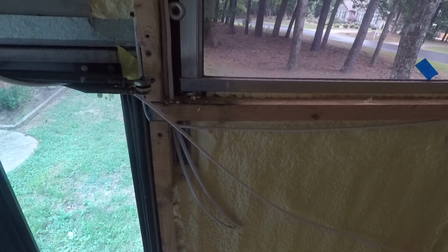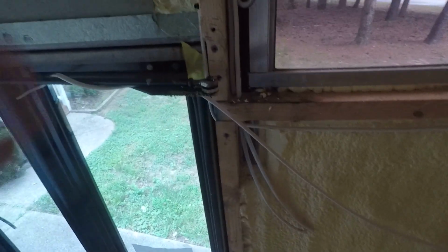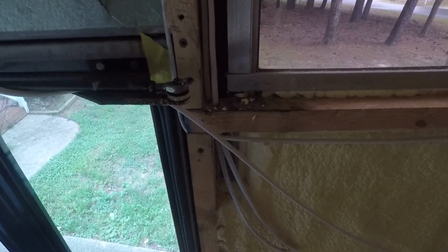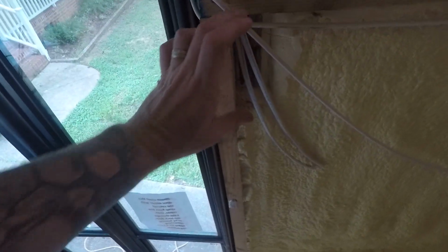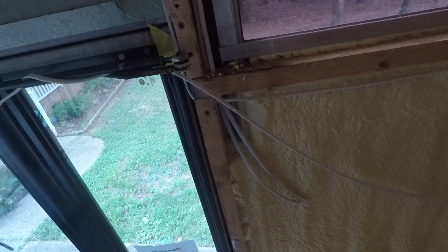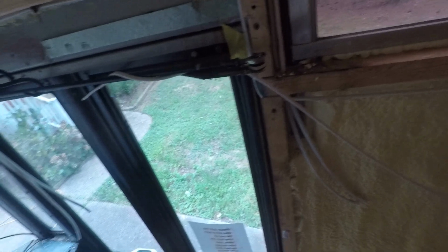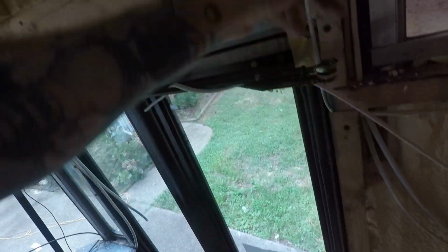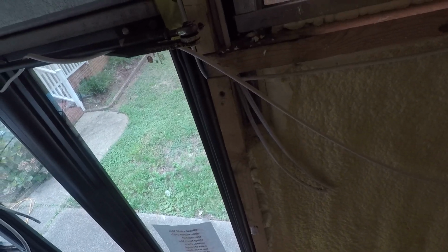I'm currently doing 24 volt DC, and I'm bringing the power basically from the fuse box, the battery. Power is coming into a switch, like let's say it's a light switch. I'm bringing the power there to a light switch that's gonna be here, for example. And then I'm running the line from that switch to the lights. But I'm also sharing the same line for the power for the lights. I'm extending it to use it for the surveillance camera that I'll be using.